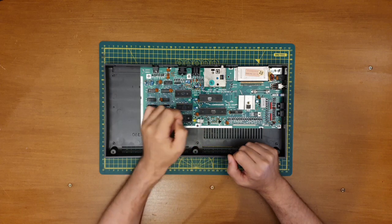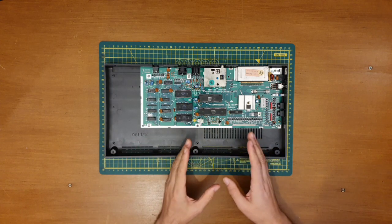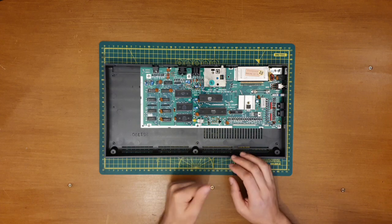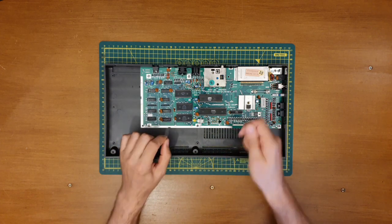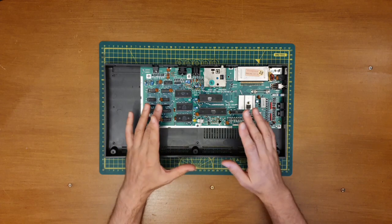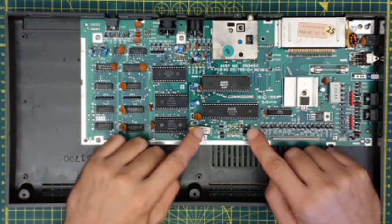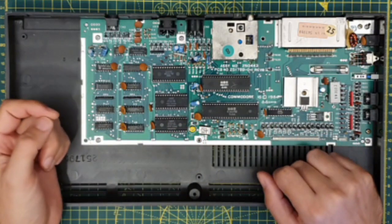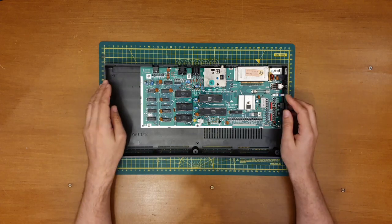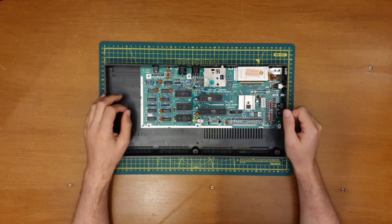This is the CPU, and here is the TED chip — and the TED chip is pretty interesting, because it handles sound and video, it processes keyboard and joystick inputs as well, and it does some RAM functions and counter control. So it's almost like a little forerunner of having a system-on-a-chip that you might find in your Raspberry Pi nowadays. This is a retro channel — I know — but I like those too.